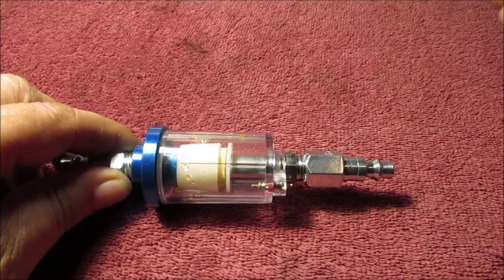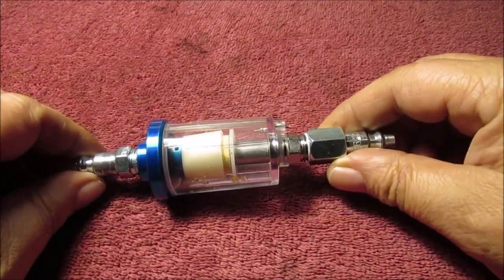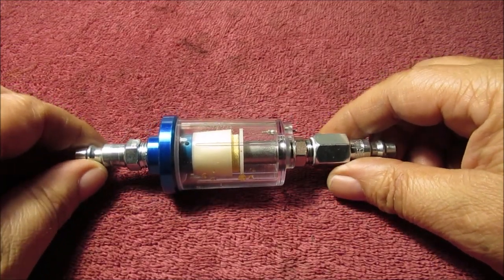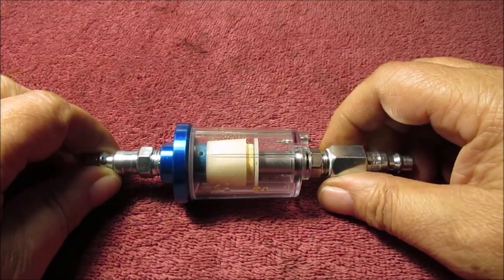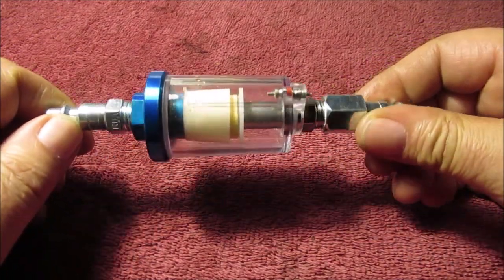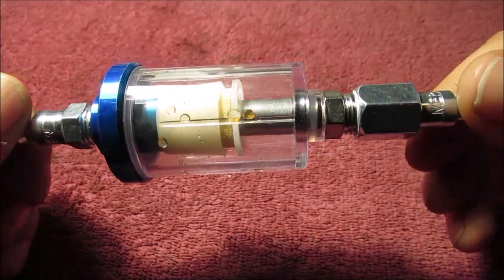Give it time for the moisture coming through the hose to condense back to water, and I think that'll be the trick, because we do not want to get moisture in our little air tank over there. No, our air tank project, that white tank with the regulator, we want the driest air we can get in there, because we may buy a small airbrush or something to use that tank for, so we got a lot cleaner air. But I will try to get a close-up of this.